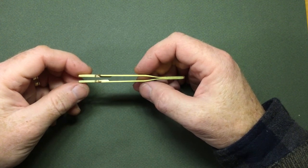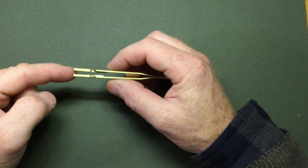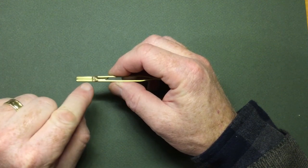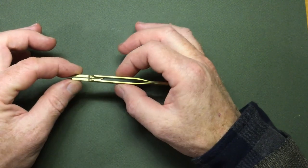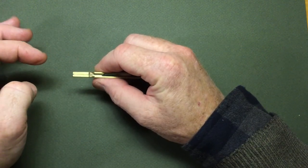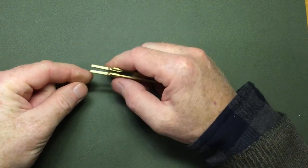So here are the finished curling tweezers. It's important to manipulate the bends in the handle so that the jaws will come together basically parallel, just as they close there. Interestingly, I've got a very slight hollow in the top jaw — a very, very tiny hollow. For the time being I'm leaving that, for the simple reason that I think it will help keep the hairspring metal in place and stop it from wanting to wander up and down if I'm not exactly precise. I'm probably also going to reduce a little bit more metal here and here, just to extend the thin section out to give the tweezers a lighter touch. You don't want to be pressing too hard to close the tweezers, because otherwise you won't be able to feel the fine tuning of the pressure that you need when doing the actual curling.